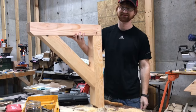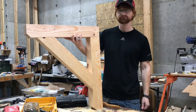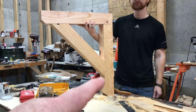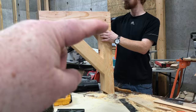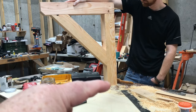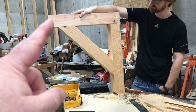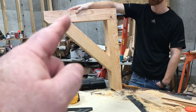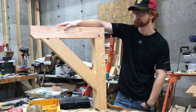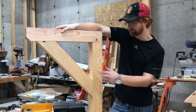That's it - that simple. That looks good and we could have made that in 10 minutes if we wanted to. Get in a groove and just cut all your pieces first. That one is 24 inches with a 45, this one is also 24 inches - that gives it asymmetry because it's plus three and a half. All I did was come back an inch and put a little bevel on it. In our case this one's 23 and a half, but you could make it 24. So literally you'd have three 24-inch pieces - that's six feet of lumber per bracket. That's our bracket, and the leftover piece goes to the next one - we're using our lumber wisely. Just a quick bracket tutorial.